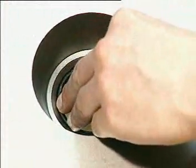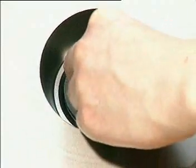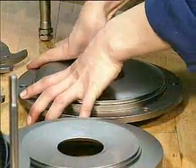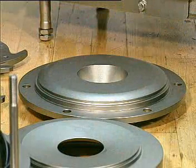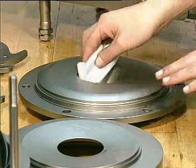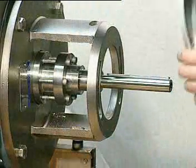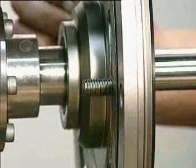Place the o-ring in the back plate. Make sure that the pin in the back plate enters the slot in the stationary part when pressing in. Reposition the back plate using the nuts and washers.